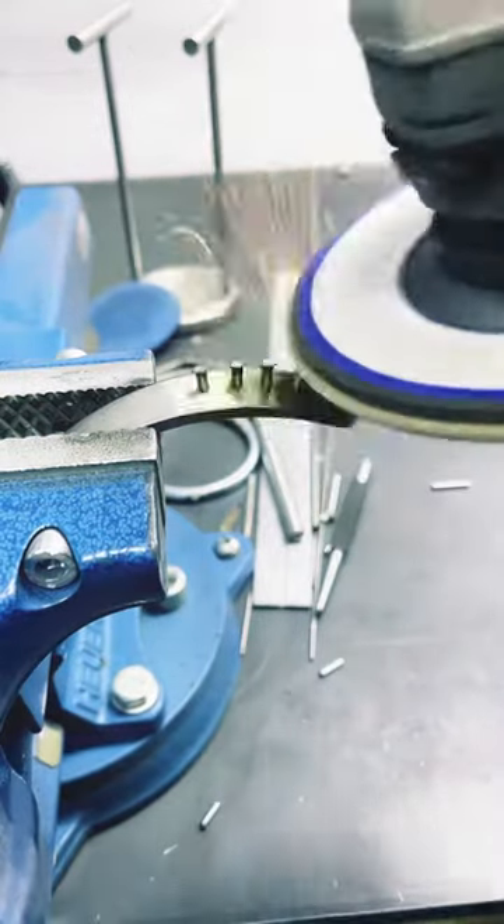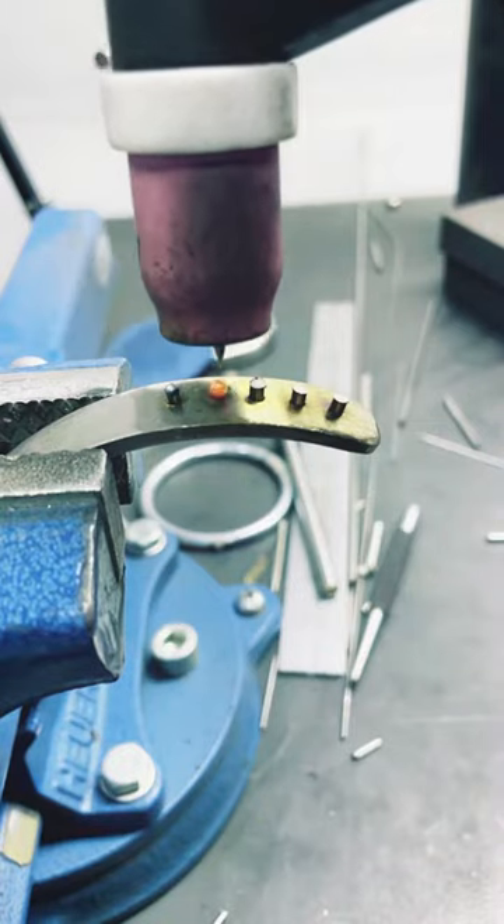At this stage they're all clearly too long, so I trim them down with my grinder and then I use my TIG welder to round the tips.